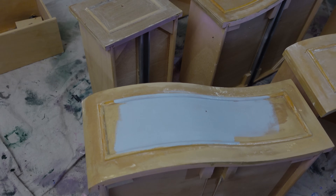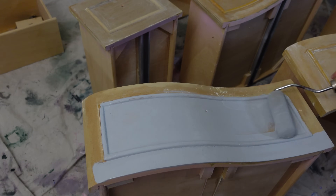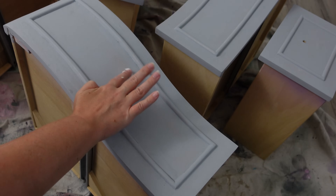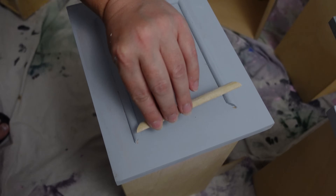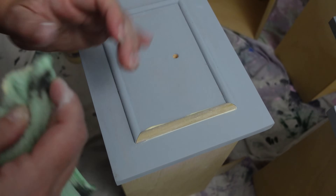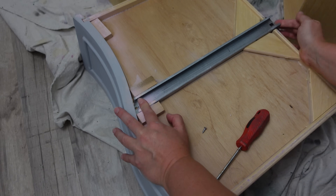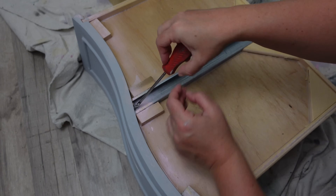Now that I have two coats of shellac on, I decided to add two coats of Dixie Belle's Boss in gray. It's like insurance for me because there were some porous and non-porous parts, and when I lay my paint down they'll be two different colors. Then I decided to actually buy new hardware. I used Dixie Belle's mud to fill in the old holes. While doing that, I realized a piece of trim was missing, but I found it and just glued it back down. Then I went back through all the drawers making more repairs — a couple were missing the rails, so I put those back on. I'm so glad they all fit with no issues.